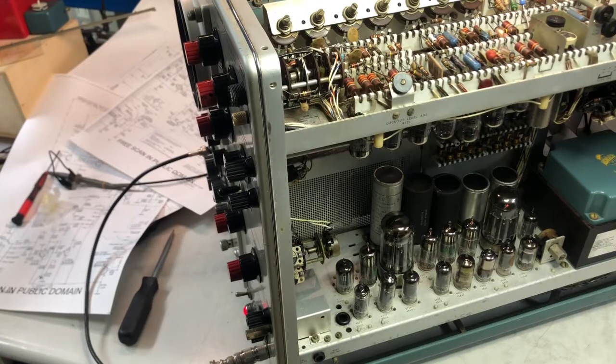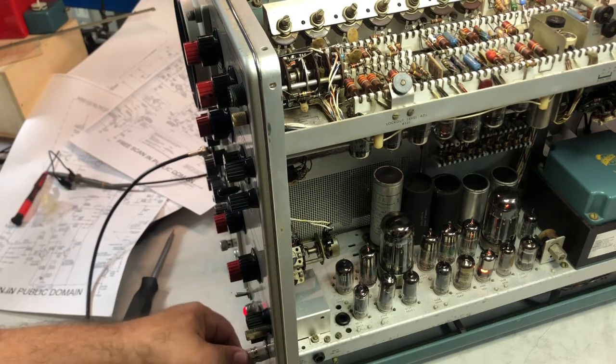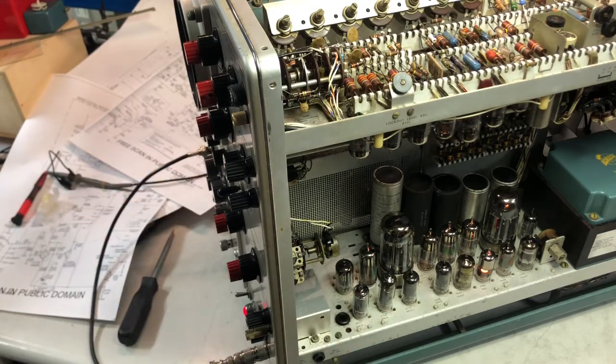I was still fighting with the rounding edges of the square wave generated by calibrator, and it was more and more like a noisy component instead of a problem of contact. Well, I started to tap here and there, and as soon as I tapped this tube, actually this one that I have in my hand, the calibrator immediately stopped working. So I started to think that we may have a tube issue, and it was correct, since it was not working at all.